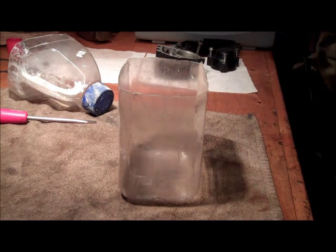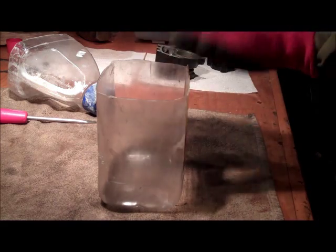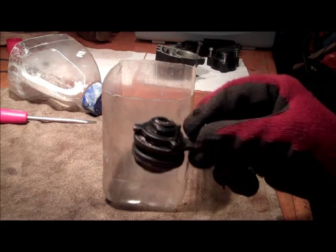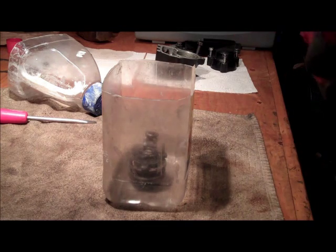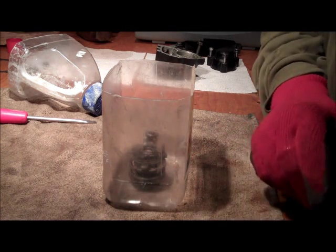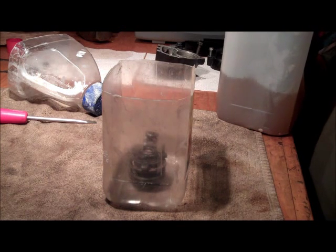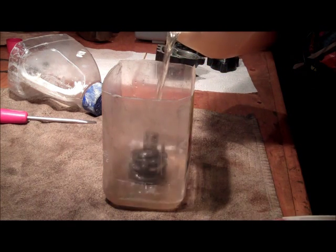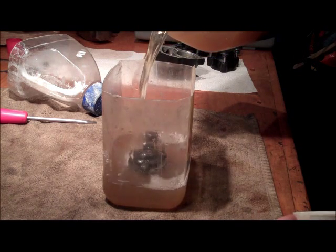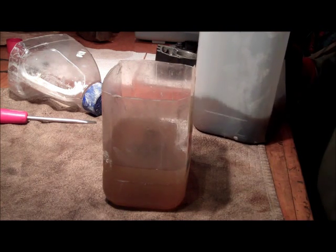For cleaning the adjustment arm, I generally use white spirit and a sonic cleaner. Clean tub - make sure it's got no holes in it. You've checked your adjustment arm already, made sure it's got all the parts it needs, all the bits are there. So you know that when you take it out, you should have all the bits when you come out - if not, they'll be swilling in the bottom of it. Get the white spirits - as you can see, these have been used before. Completely submerge the part in there, and then over to the ultrasonic cleaner.